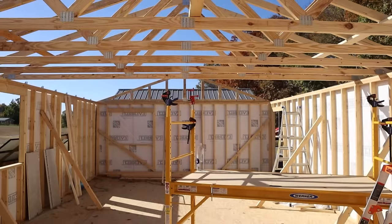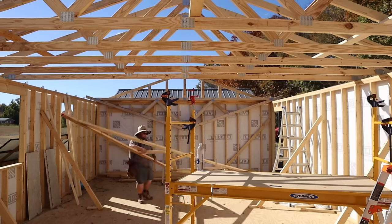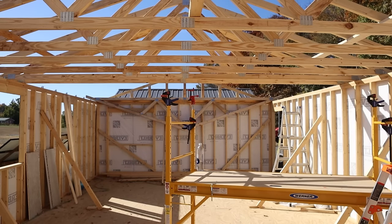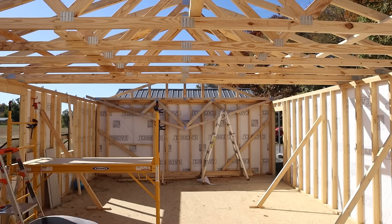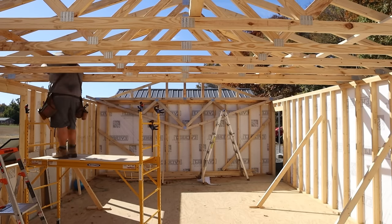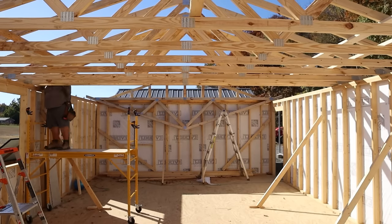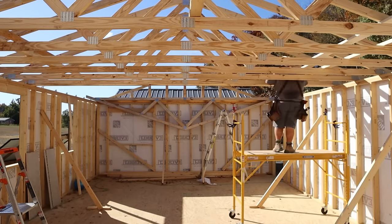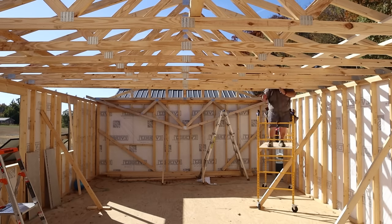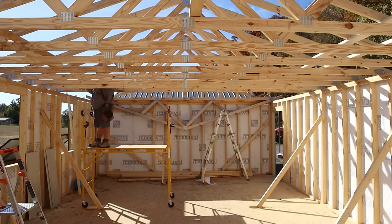At this point, I only have 7 left to do. So let me go ahead and fill in the rest of these, ones that are actually purely identical to what you've already seen. And I'll see you guys when we get over here to this gable end. When we do the creative work there, I want to show you a thing that you need to do so you don't forget. And then we'll build our last ladder rake, I believe is what it is. The 2x4 boards that hang over the drop truss on the end and then form out my eave. And then we will have made a huge milestone and great accomplishment in the workshop today.